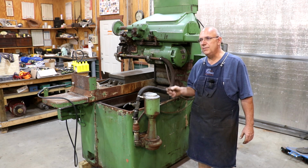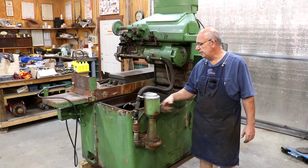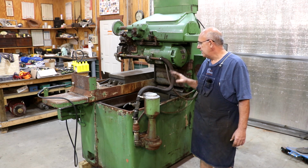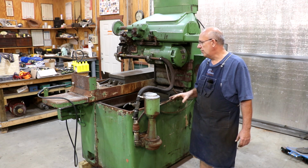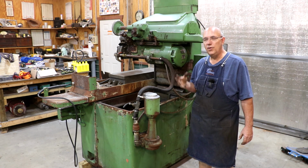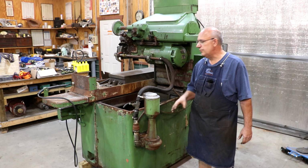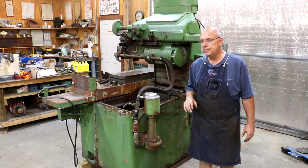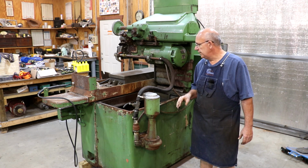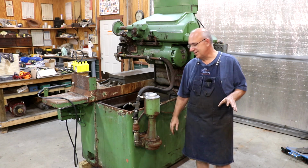It's not something that they make, but they do stock transformers, and I think we're going to put a 15 kVA transformer on here that I can run off of a 30 amp, 220 volt, 3-phase circuit. And it'll step the voltage up to 440. The amperage will drop down to 15 amps, but that'll be more than enough to run everything on here at 440 volts. So that's kind of my game plan if everything goes as planned.